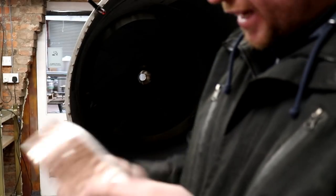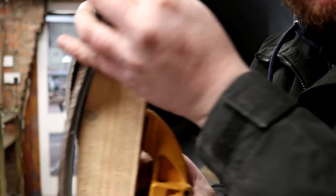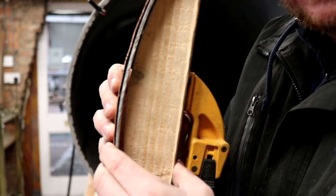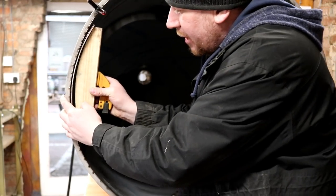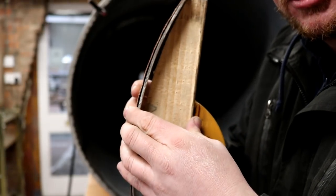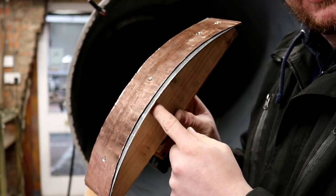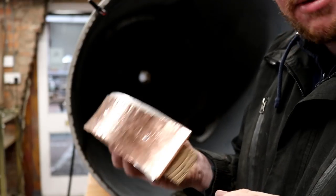A slight modification to the backing bar - what I've done is taken out the three screws and just put the one screw at the top and over-bent the inside. That gives me a bit of flex on the inside of the tank, so when I push it up, if there's any gap that should be taken up by the flex within there. It's sort of hinging like a van suspension spring, should push up nicely. There's also a bit of a gap between the timber and the aluminium, hopefully allowing a bit of cooling and not setting my timber on fire.